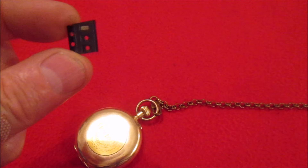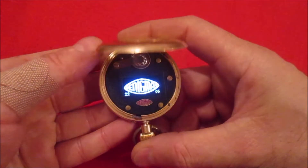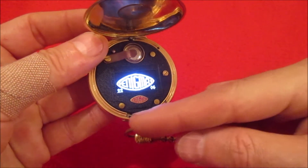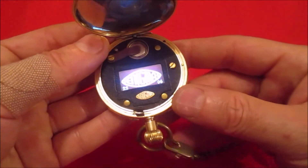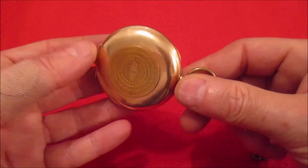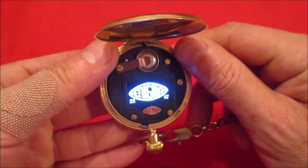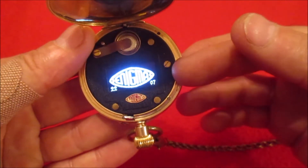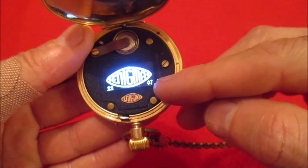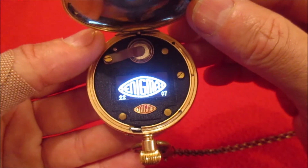It's hooked up so that when the watch opens, it reads from the chip and displays the time in the bottom corner of the splash screen — 24-hour time, just hours and minutes. The RTC chip is wired directly across the battery, so it is powered even when the Arduino inside the watch is turned off, and reading it is pretty much instantaneous. As soon as you open the lid, it's read the time and it's displaying it on the screen. It only reads it once on startup, and then the internal clock of the Arduino keeps the time up to date.